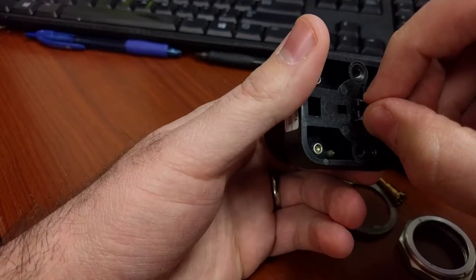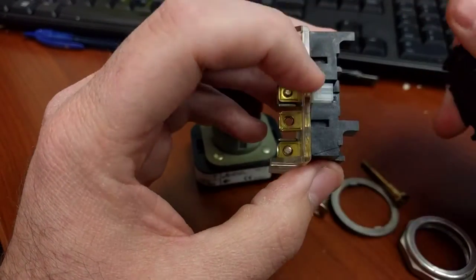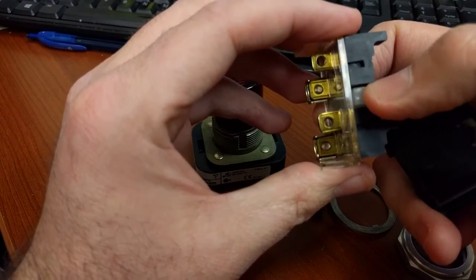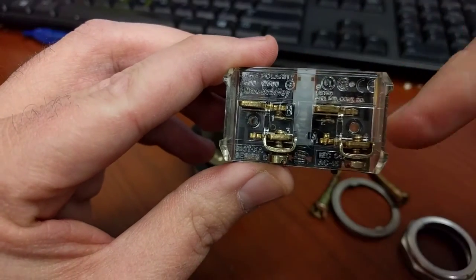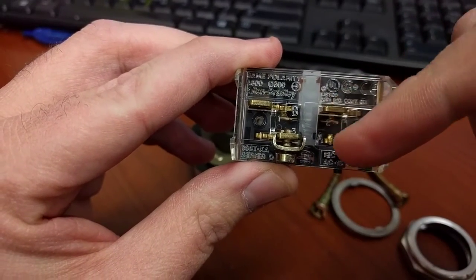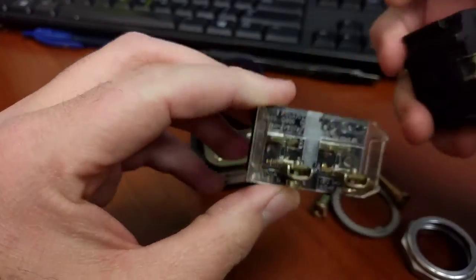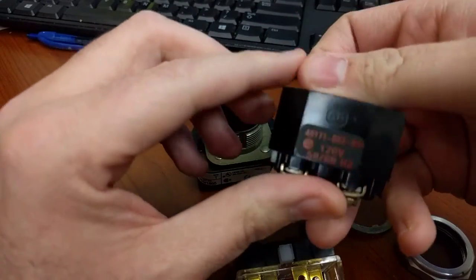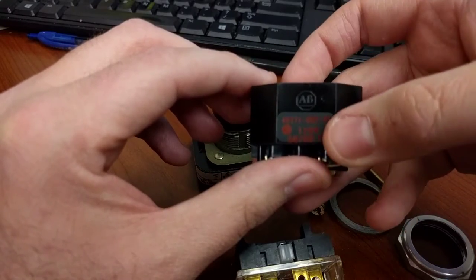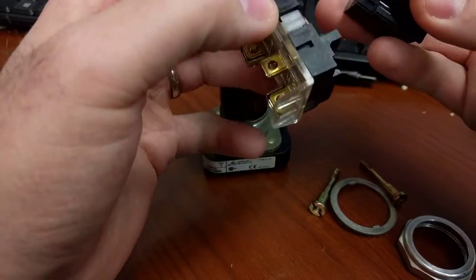I've got my positive and line-in neutral for my light bulb sitting right here. If you look on the flip side of the contact blocks, you'll see a little plunger that will go in and change the contacts. You can see it going between one contact to another as I push in — from the normally closed contact to the normally open contact. And then here is my base for my light bulb, and as I said earlier, the 120 volts and everything.